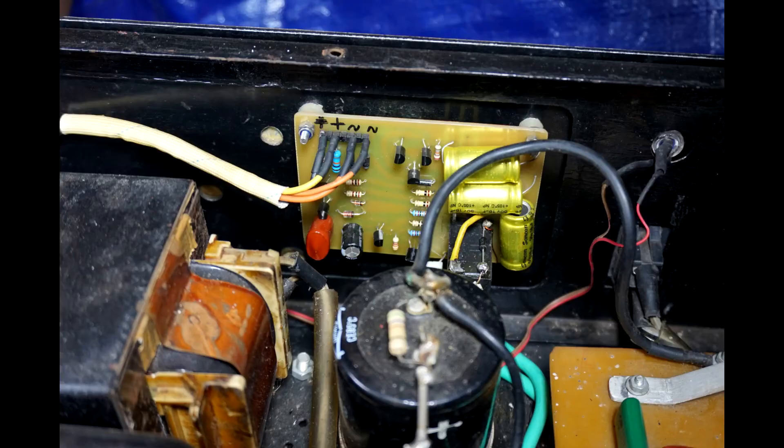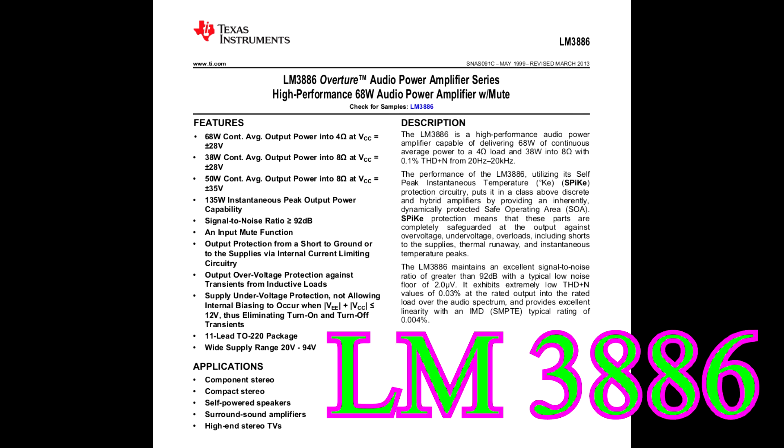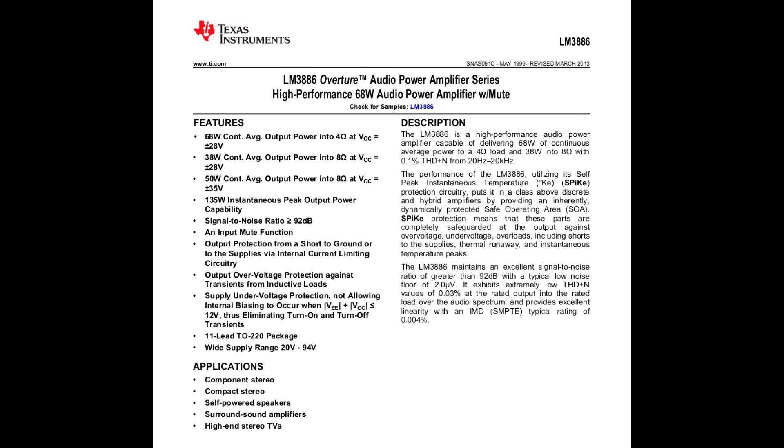At the front here is the speaker protection. The amps used for the five-channel surround sound are the LM3886, which can easily deliver 50 watts into eight ohms. I'm only using two channels, and as the crossover frequency is 150 hertz they don't need to handle any bass, so the speaker boxes can be small and low cost.